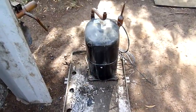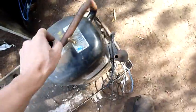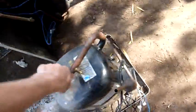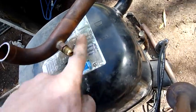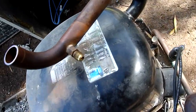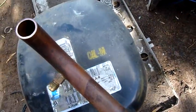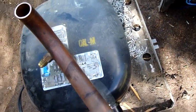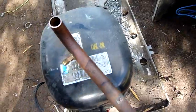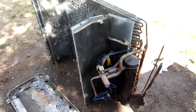We'll keep the compressor for a bit later on as an experiment. Big old Tecumseh compressors — there's an AG188UT. 460 volt, 60 hertz. 380 to 420 volt, 50 hertz. 79 locked rotor amps. Three phase only. Pretty decent.